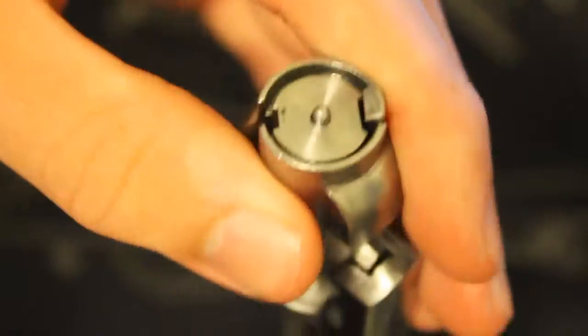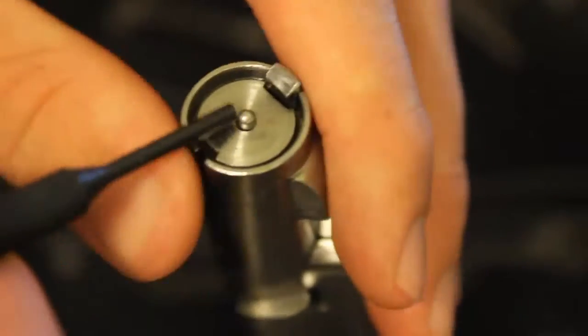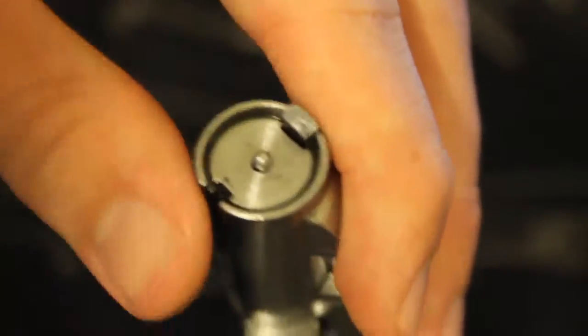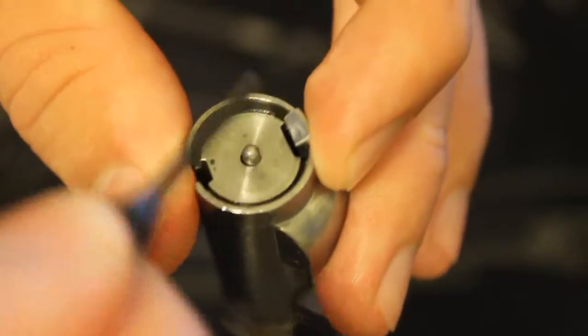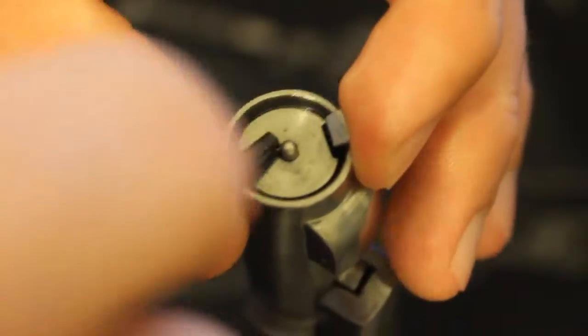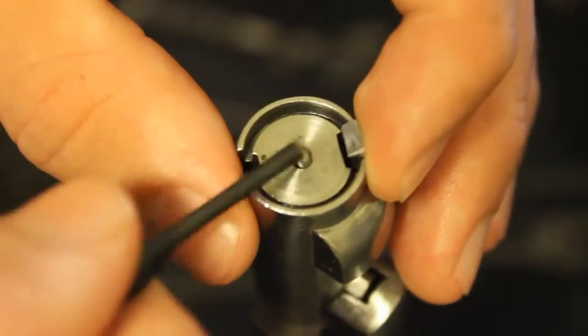It doesn't hurt, and it's going to save you a lot of frustration in case your firing pin is sticking out too far, or you're going to get light strikes, which can also be dangerous with delayed fires and such, although it's rare, but sometimes it happens if the firing pin is not coming into good contact with that primer. So just keep those things in mind, folks.